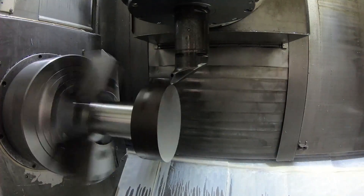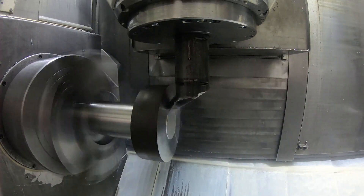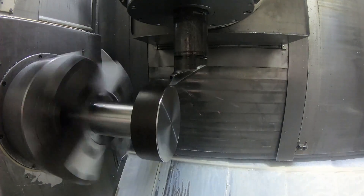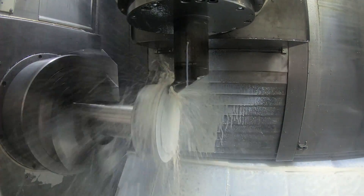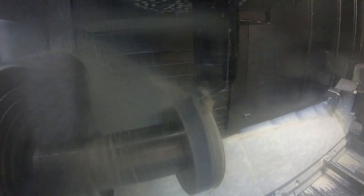So I didn't get the rest of the shots of finished turning that, but more or less I'm turning it down to the diameter to fit through the parts, the blanks. And here I've turned it around and I have it in some soft jaws in the chuck and I'm facing and turning the other end of it to dimensions that I drew on the CAD software.